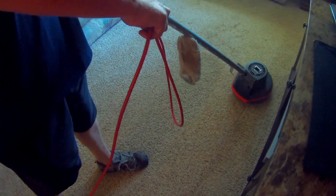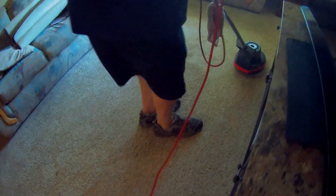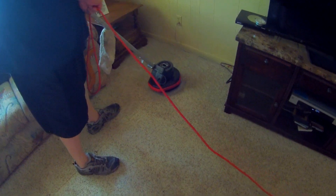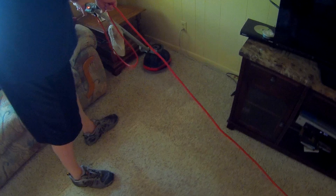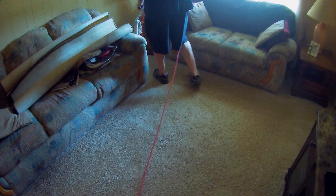These carpets typically, when we clean this way, they dry in about an hour, maybe two hours, depending on how much spray we put down. If they're really dirty we get them wetter; if they're not real dirty we get them moderately wet. We like to clean with enough dampness that the bonnet spins real fast — the faster it spins, the faster and deeper it cleans. You want the carpet somewhat wet, you just don't want them soaking where they're going to be wet for eight hours. Nobody needs to get carpets wet for eight hours; it's just no longer necessary.